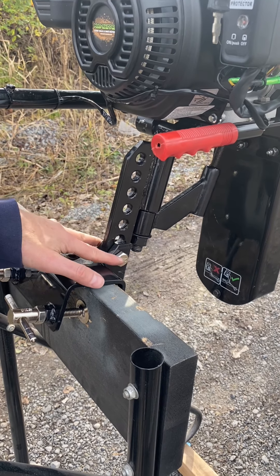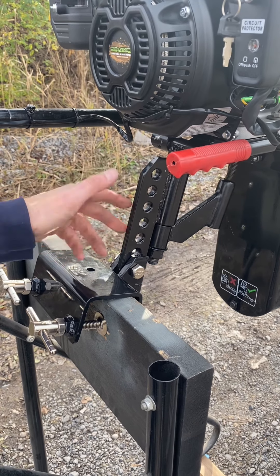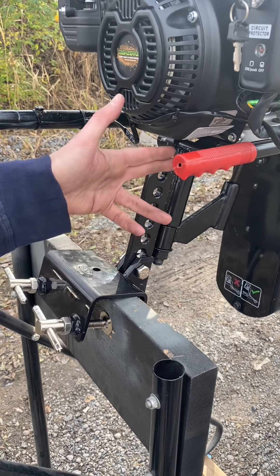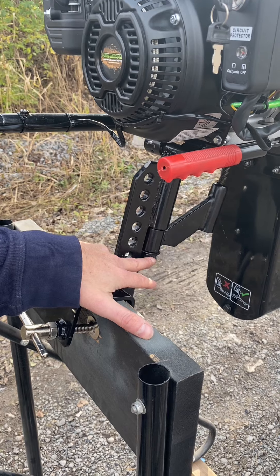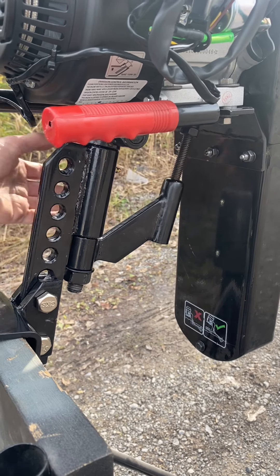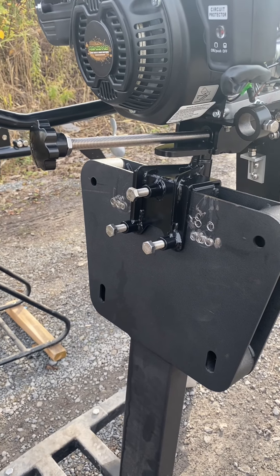There are several ways to adjust the SE200 on your boat. To raise and lower the kit you'll see these two zinc-plated bolts here — you need to physically remove the surface drive from the transom mount and change the height at which it sits. That is definitely complicated and difficult, and not something you want to do on the water. The transom post is held on by one regular nut with a washer, and if you want to adjust the trim while driving, there is a trim transom post underneath that you turn with a wrench or by hand — also not recommended while driving.